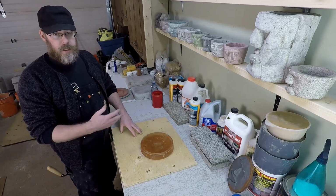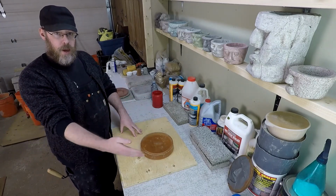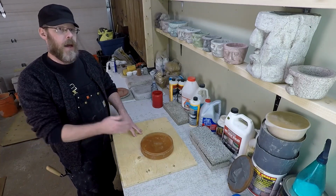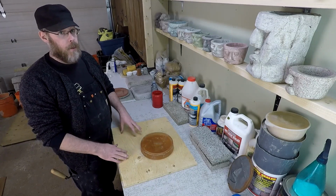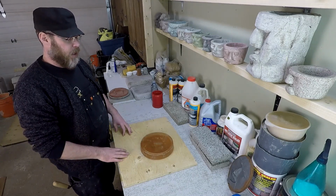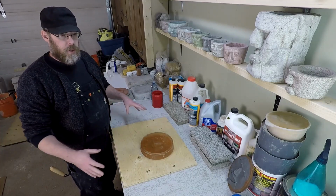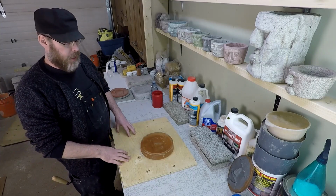If I were pouring a sidewalk or a deck around a swimming pool, and I'm going to need a couple of trucks of concrete, I'm going to be very concerned that truck 1 doesn't really match truck 2, doesn't really match truck 3. It happens all the time. So definitely don't underestimate that. If you're thinking, well, that shouldn't be a problem for me, it might very well be, unless whatever you're doing can be done in a single batch and you're willing to accept whatever kind of results you get.